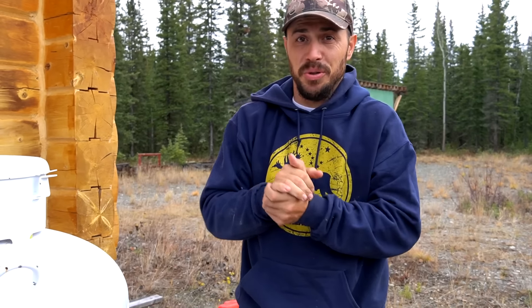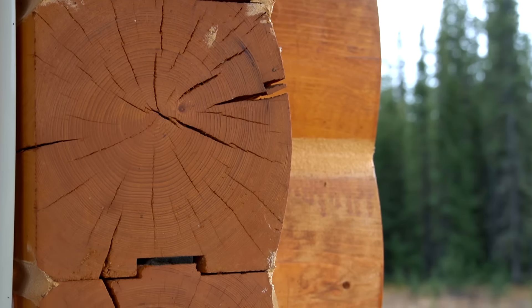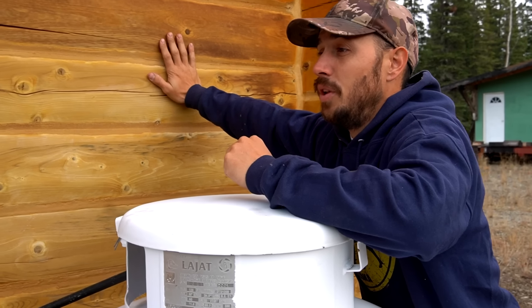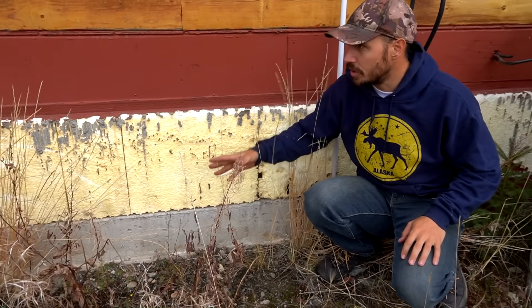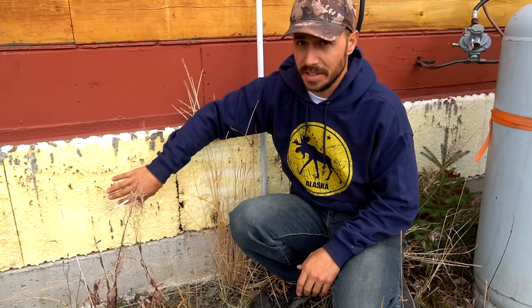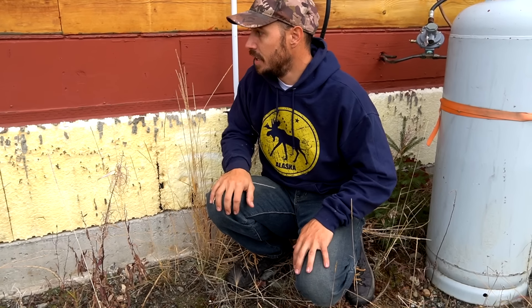It is definitely getting chillier - this place is a lot colder than where we live, and it's absolutely awesome. It came with another little generator that runs the whole system here - it's one of the same generators that we have at home. This is the outside of the cabin. As Ariel mentioned, it's D-logs - these are 8-inch D-logs and they're actually grooved or notched so they fit together. It's an extremely high-quality design. She mentioned this is on a foam concrete foundation - you can see the foam and then there's concrete inside, and the footer down on the bottom is also concrete. Our cabin at home is up on piers and beams, so this is going to be superior for insulation and being able to have a crawl space that's kept warm for water lines and anything you want to put in there.